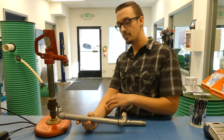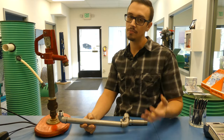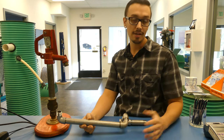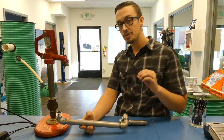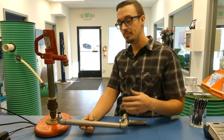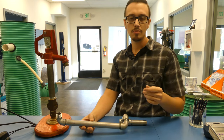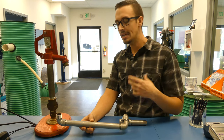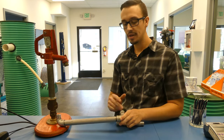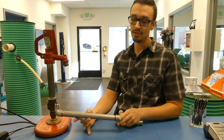Another crucial thing to mention is this is stainless steel. Anytime you're working with stainless steel, it's a really hard metal and can sometimes be difficult to seal. So if you're using it in a swing joint where you're most likely to encounter movement, you want to make sure that you use pipe dope in addition to teflon tape. The pipe dope acts to give a liquid seal and will eventually harden a little over time but stay relatively liquid. The teflon acts as additional sealant in between. That is a manufacturer recommendation to use both, so I'm going to recommend that as well because it makes it a whole lot easier to seal these up.